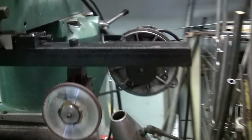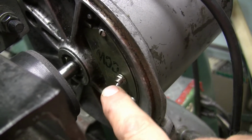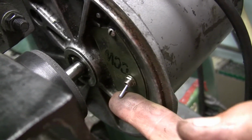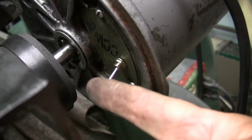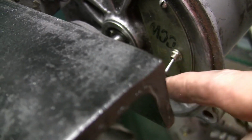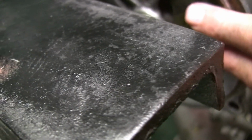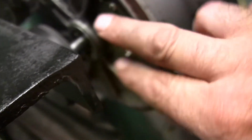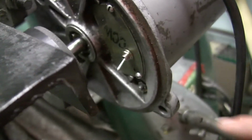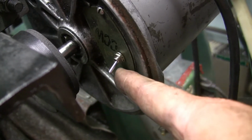Plus, that motor that I have, I wired a reverse switch, so one way it runs one way and the other way I can reverse the motor. I've done that with all my tools that I've built, just taking the motor and you can wire them up to run opposite just by switching the two field wires around in there. It's 2 and 4, I think it is. Switch the wire from number 2 to 4, and the wire from 4 to number 2. But anyway,